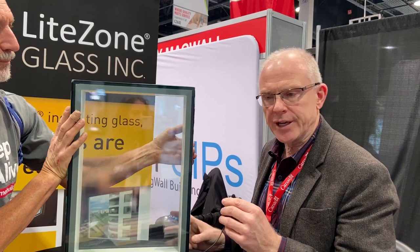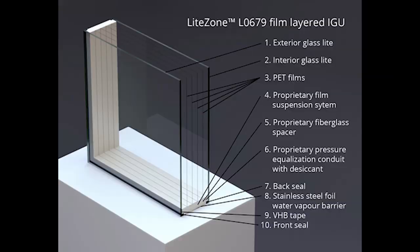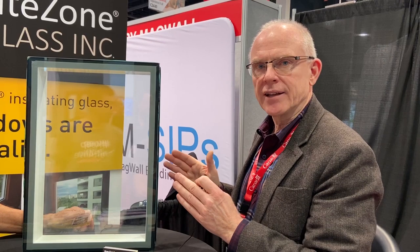That frees us up to make the glass as wide or as thin as we need. We can add layers of lightweight film — as many layers as we want — to increase the overall insulating value of the glass. We use films because as we add layers, the weight of glass would be a problem. We can add between one and up to eight layers of film, achieving a window of R17 to R20 center of glass, but up to R17 for the overall window including the edge effect and the frame.